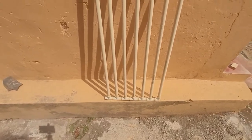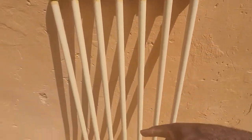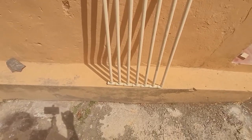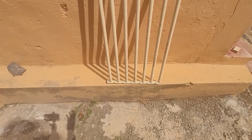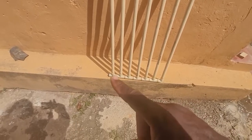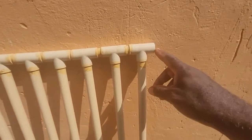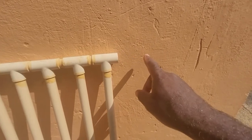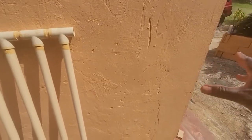You do not want to put the water through here and have it exit at the bottom, although that may seem the most obvious thing to do. I'll explain later that it can actually be done depending on your water source. To continue — the water will come through here and fill all these tubes, then the water will exit here. What you are going to have is a control tap attached right here.